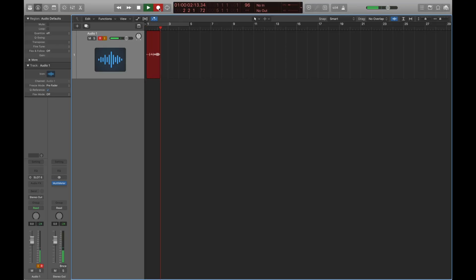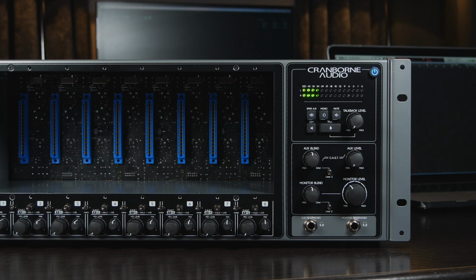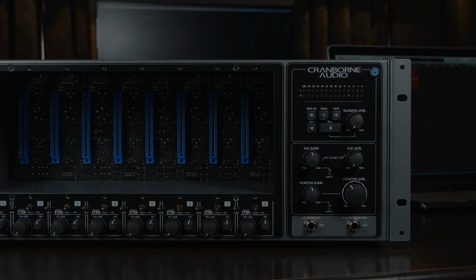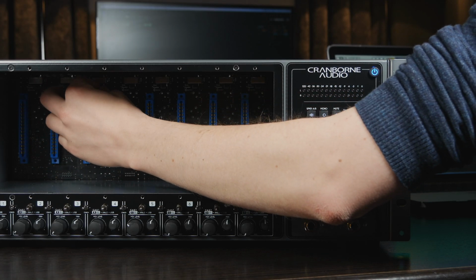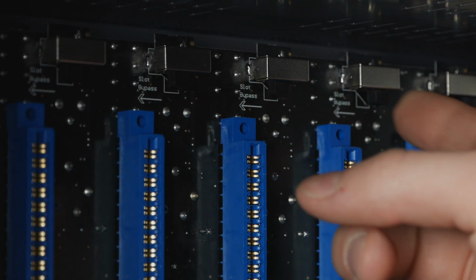When a slot is bypassed, the analog XLRs and converters can accept up to plus 24 dBu input level, which allows you to connect mixing consoles, external preamps, and other hot output devices without fear of clipping your converters. You can even utilise 500R8's analog summing mixer in its full capacity, whilst the slot bypass switches are engaged.